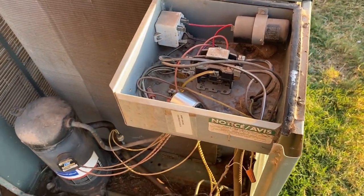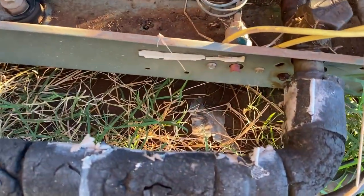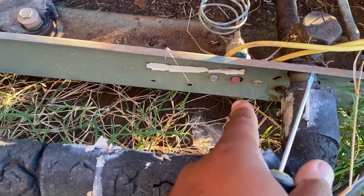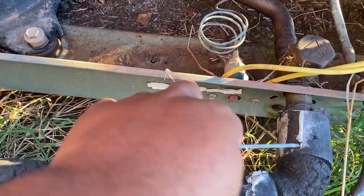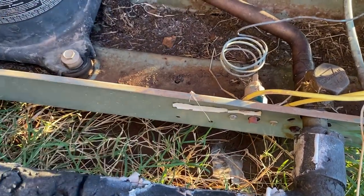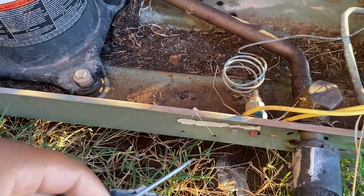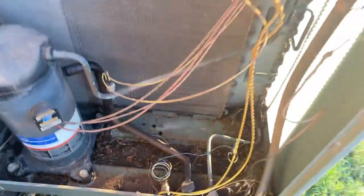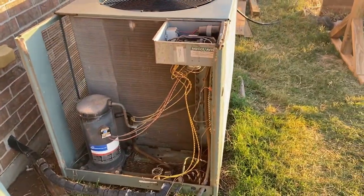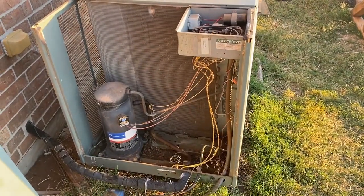Today I just wanted to show you something basic. Let me show you what I used. If you see mine down here, this little reset button for the compressor — the high pressure reset button — my button is kind of chewed up. So I took a flathead screwdriver and stuck it in there, and it kicked right on. That'll reset it. Out here where I have a lot of power outages and issues, this is very common, and it would have cost somebody coming out here a minimum of 200 bucks. But now we're good to go.